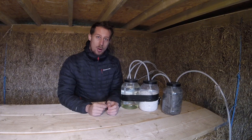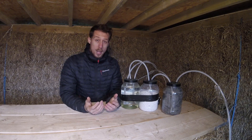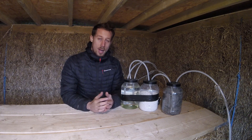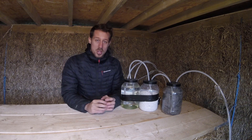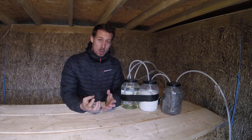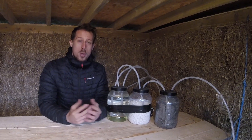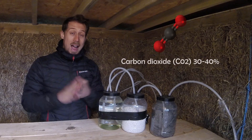Before we get into how to set these up with the digester, I just want to go into a little bit about the why. When we put all our food and manure into the biogas digester, we're digesting in an anaerobic environment — without oxygen — and all those carbon, hydrogen, and other elements in those food and manure items are going to get turned into either sediment or some kind of gas. We're interested obviously in the methane, but most of the time when you're producing biogas you're getting methane, carbon dioxide, and hydrogen sulfide.